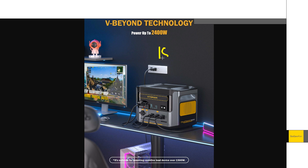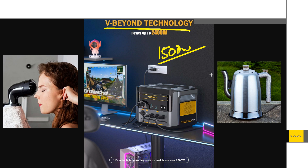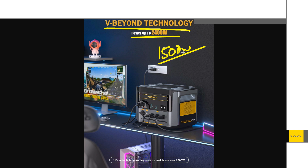We do get a 1500 watt continuous inverter. All these companies come up with some silly name for this feature where it drops the voltage so you can run resistive loads — kettles, hairdryers, stuff like that — if they typically draw more than 1500 watts. They're saying you can do that up to something that would typically draw up to 2400 watts. I haven't seen any mention of an app with this unit, so I'd be cautious — I don't know if there's a way to turn that feature on or off. That's kind of a question mark.